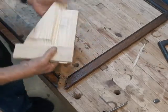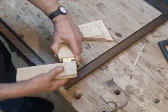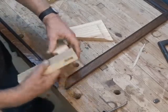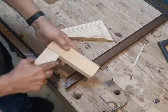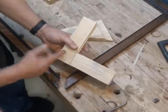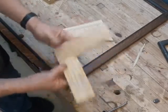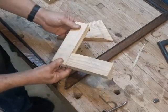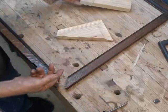Originally, we did have the good old mortise and tenon joint. The tenon here, the hole, the mortise. And that was a very strong joint, especially when you couldn't rely on the glue. You could put pegs through here to hold it together, and it resisted racking and twisting and all other kinds of problems. In other words, a pretty good joint for all purposes. It is expensive to make.